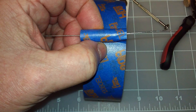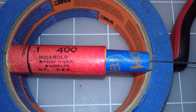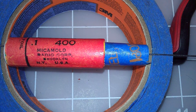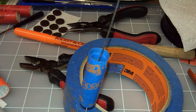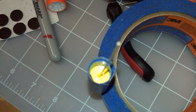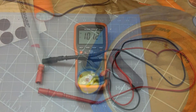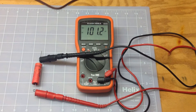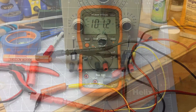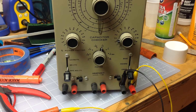It's now time to stuff the new capacitors in the tubes. I elected to use painter's tape to increase the diameter of the new yellow capacitors for a firm fit into the tubes, paying close attention to not have the tape make contact with the conductors as illustrated. In addition, I tested all capacitors before installing into the tubes — that is the values and for leakage — and repeated the process after installing into the new tubes.